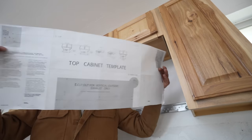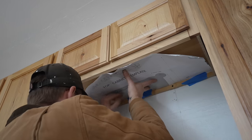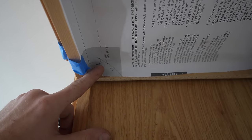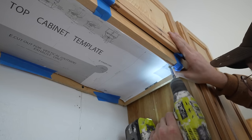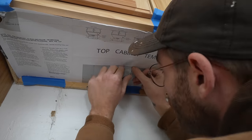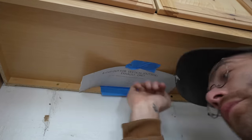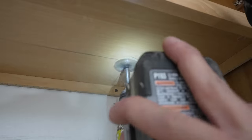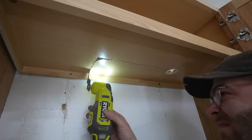Your microwave should also come with a template for your top cabinet. This will help us lay out lines where we need to cut out for our vertical exhaust, as well as the filler blocks we need to create since the bottom of our cabinet is recessed. These holes are where mounting screws are gonna go through the cabinet and into the top of the microwave, so I drilled these out first. I used a Forstner bit because they tend to give a really clean cut, but you could also use spade bits. I'm cutting away part of the template to trace out with a pencil — the section of the cabinet I need to cut away so the ducting can vent through. I used a 2-inch Forstner bit to create the circle cutout where the power cord feeds through, then used a jigsaw and an oscillating multi-tool to cut the remainder away.